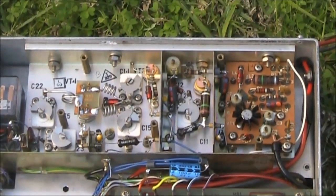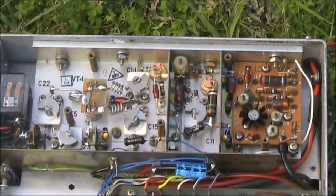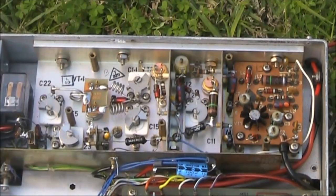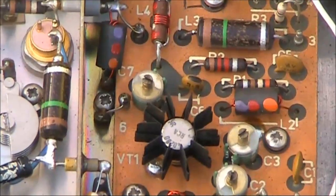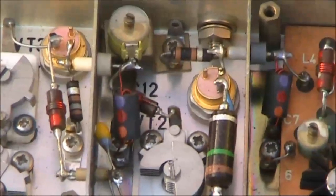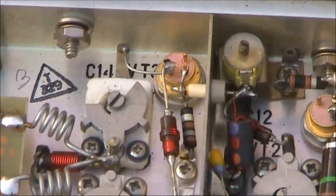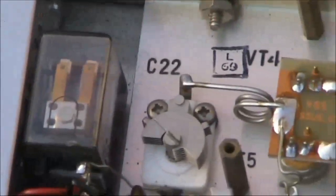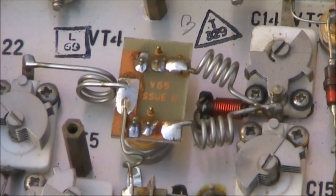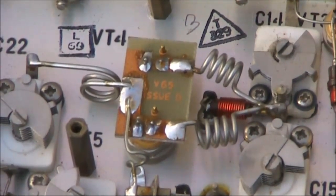Just behind the back panel is the RF amplifier strip. That amplifies the FM signal up to about 15 or 20 watts. It doesn't have to be linear since FM is just a carrier with some frequency modulation — you can use a class C amplifier, which is simpler and more efficient than amplifiers used for SSB. Let's say you've got a few hundred milliwatts here — this transistor would boost it up to maybe a watt, possibly a bit more. Then this one here, maybe three, four or five watts. And then the highest power transistors — there are actually two underneath that little circuit board, possibly some sort of push-pull arrangement — and that will get you to your 20, 25 or 30 watts, whatever this transceiver puts out.